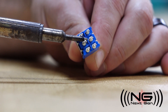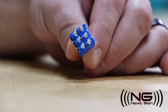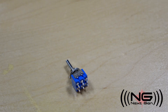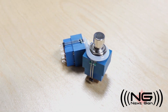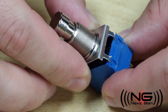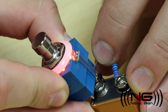Less commonly, a soldering iron held too long against the contacts while set at too high of a temperature can heat the plastic enough that it will melt and the lugs will move out of place, at which point it would be recommended to just replace the switch. These maintenance tips also apply to stomp switches like the ones mentioned in our previous Inside Out video. Check that one out to see a breakdown of a 3PDT stomp switch with a built-in LED ring.